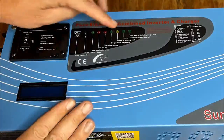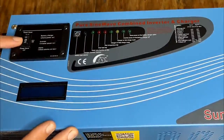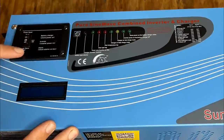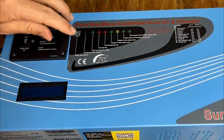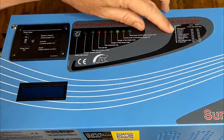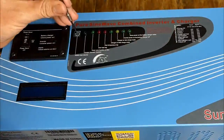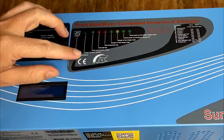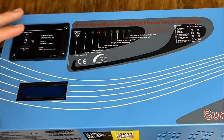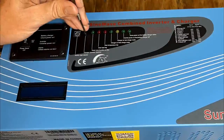Here's a look at the front of the unit. There's a bunch of status lights and an LED display to let you know what's going on. This here is the power switch — in the middle position the unit is off, and you can toggle it in either direction to turn it on either with or without power savings mode. Right here is the battery type selector, and it comes shipped by default in position one which is Gel USA. I'm going to be using sealed lead acid batteries, which is setting number four, so I'm going to switch that right now. And this knob right here is for the charge current control — this can actually charge your batteries at 40 amps at 24 volts, or about a thousand watts. I'm only using a two-battery bank, so I'm going to turn this down.